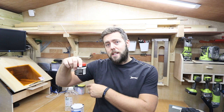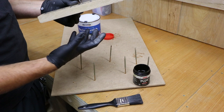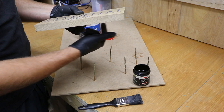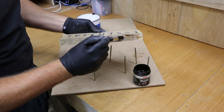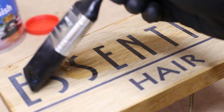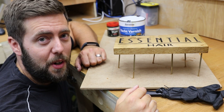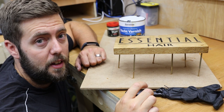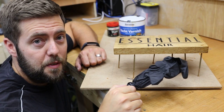It's a fairly simple setup: a nice clean brush, and a scrap piece of MDF with a few screws to hold the wood and catch any dribbles. I'll apply a coat around the edge first, making sure I get into as many cracks as possible for protection, then apply a coat to the back and then the top. That's our first coat applied and as you can see it starts to bring out all the beautiful features of the oak as well as taking the Milliput back to a deeper black. We'll leave this to set for quite a few hours, then apply a few additional coats of yacht varnish with a light sand in between each one. Any gloves you dispose of can be used to wrap your paintbrush in — that just stops it going off between coats.